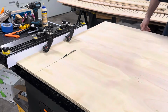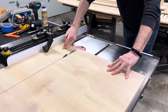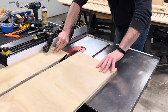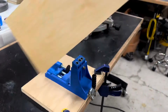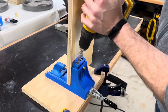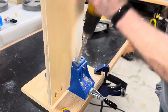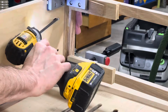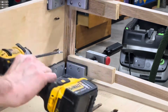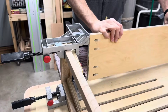The interior framework was made up of more of the sand ply that was left over from making the top platform, plus lots of different random pieces of plywood I had left over from projects this year. This piece is the footboard, and it's actually some pre-finished ply that was left over from the curved corner cabinet project, and I put some oak veneer on the other side that will be the one that's exposed. I did the construction with a mixture of pocket screws and dominoes where appropriate, and I tried to have glue as well for every single joint.